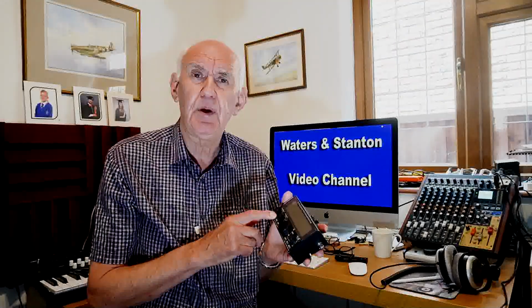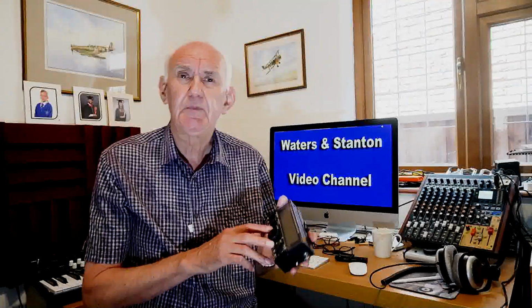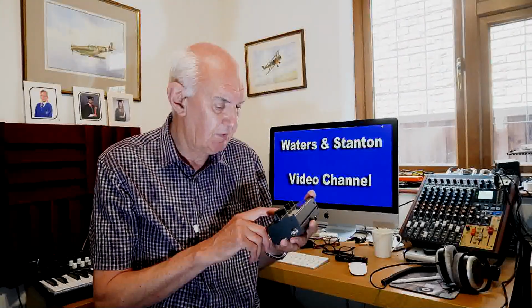You've got a preamp and an attenuator built in there. Obviously an electronic key built in there. You've got a message recorder there. You can record short CW messages like CQ, and a couple of voice messages, again like CQ. And if you're using the built-in microphone, it saves you having to keep repeating CQ, just press the button. You've got a transmit button there, so you can manually go on to transmit. There's another button to hold down. It'll give you a low-level carrier for adjusting the ATU.